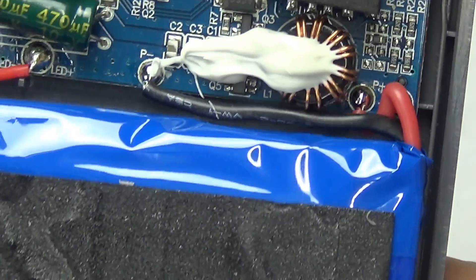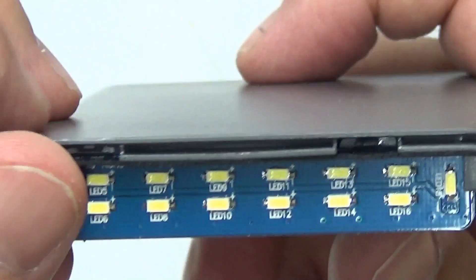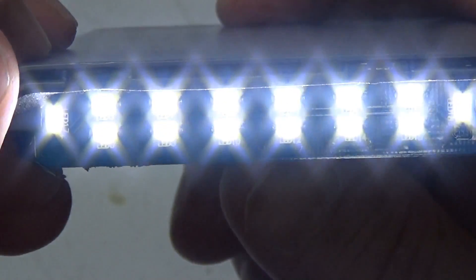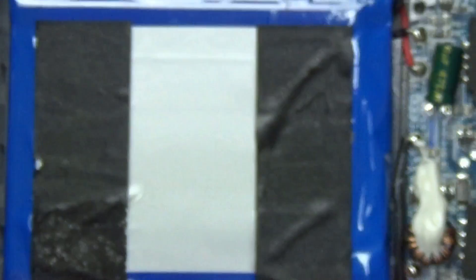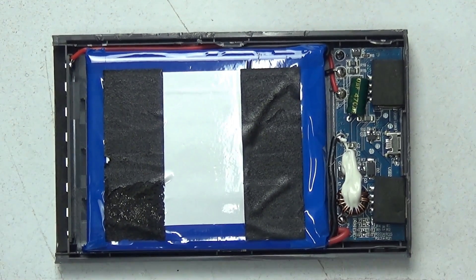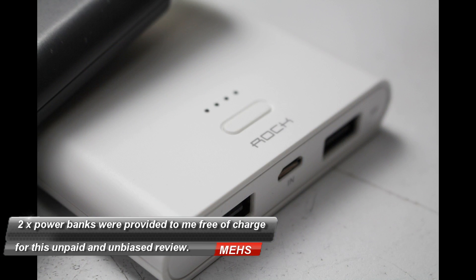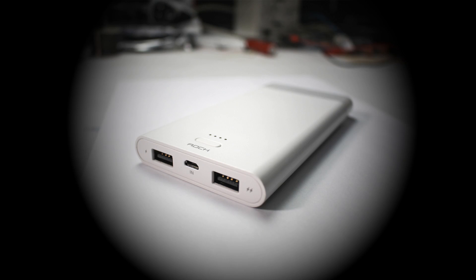Overall, I think this is a bargain as long as it stays at the $20–$25 price point. It meets or comes very close to meeting its claimed 2.4A output and can simultaneously charge an iPhone and a tablet, and it can be recharged while doing so — at least with an iPhone or something equivalent attached. The battery capacity seems realistic based on the indicator drain whilst charging devices, and considering a full charge from empty takes about 4 hours using a 2.1A 5V supply. I've put the link to the power bank in the description for those interested. Thanks for joining me — please like and subscribe, and I hope you'll join me again next time.